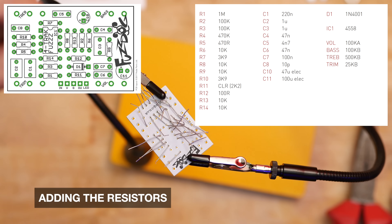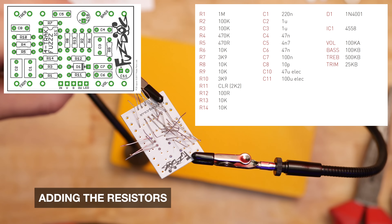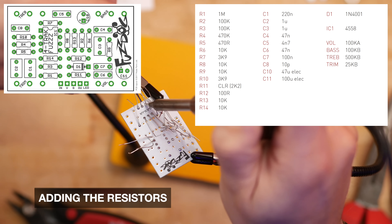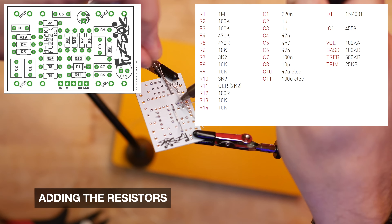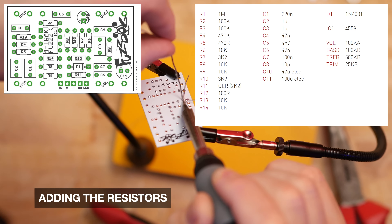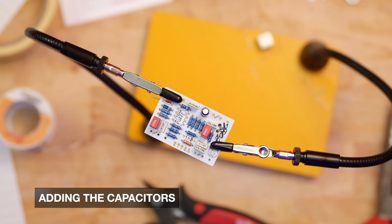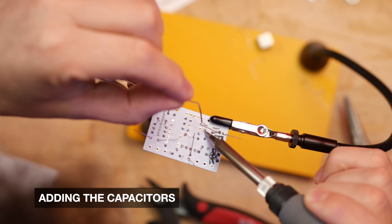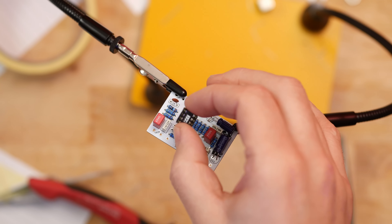Up on the top left of the screen is the circuit layout diagram showing you R1, R2, etc., and on the right it also shows R1, R2, etc. All you have to do is combine those two pieces of information: find the slot for R1 on the circuit diagram, then on the right find out which resistor you need. For R1 it's the one-meg resistor, and then you put the one-meg resistor in the slot for R1. Because resistors can be put in either direction, as long as you've measured your components correctly and labelled them, and then follow these two pieces of information, you can't go wrong.